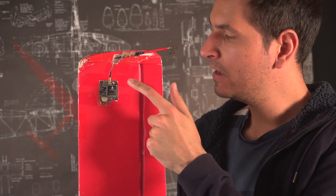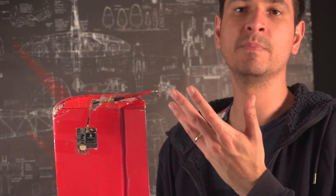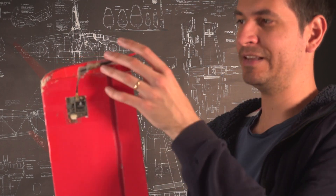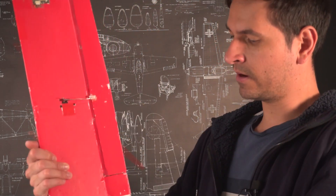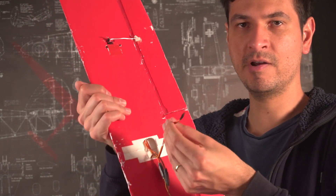This is what I ended up with — the video transmitter on the tip of the wing, very separated from the other electronics. Although the frequency of the receiver and radio is very different from the video frequency, I like to keep them separate to reduce interference. Placing the antenna at the wing tip means no obstacles around it. This is a very powerful 5.8 GHz video transmitter, and from there I run a cable down carrying only power and video signal.